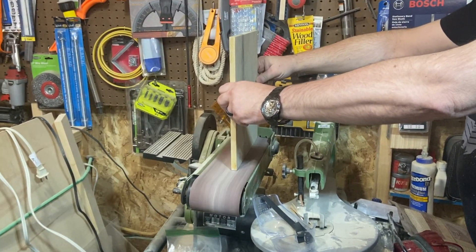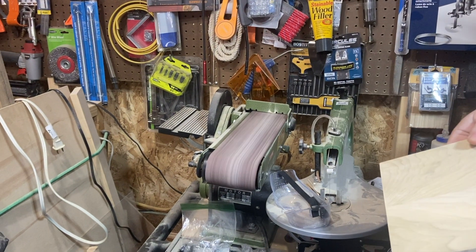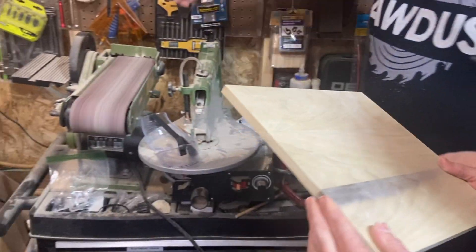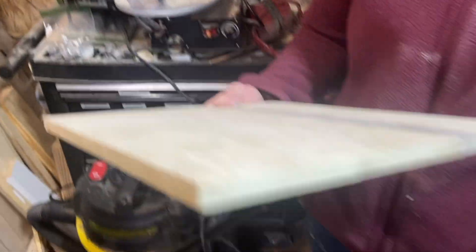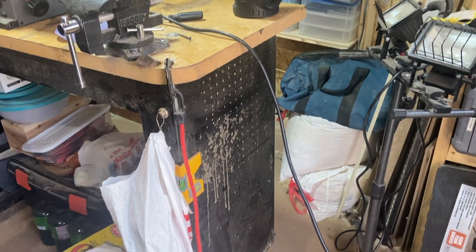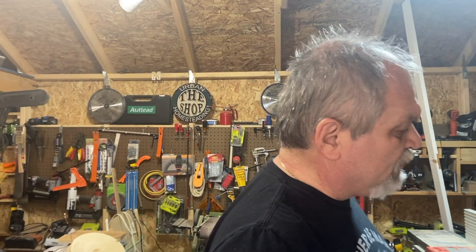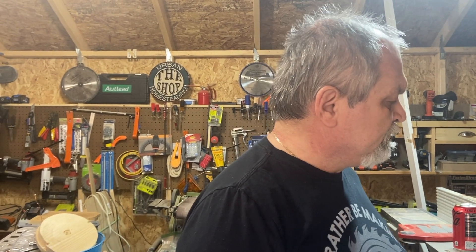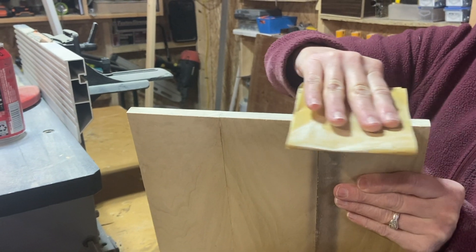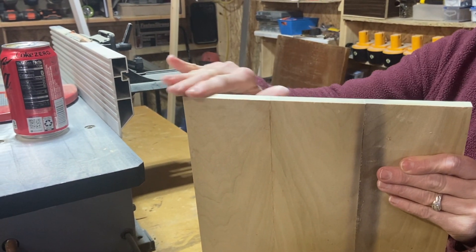It looks pretty solid — this is why you need to do this right. This side looks really good, the other needs a little bit of planing. If you don't have a planer, you can use sanding for this, but we're going to use our thickness planer. If you don't have one, sanding will do a nice job. This just does it a little finer and a little faster — much faster actually. So if you have it, it's nice to use.